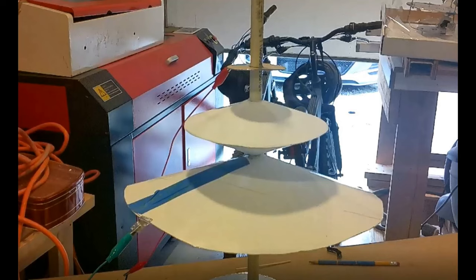Ion wind requires an anode and cathode. You would have to put something in here that was metal on the top and bottom. By changing to this configuration, and we take all of the aluminum foil on the bottom, you absolutely have none that's available to make the connection of ion wind, we can then rule it out. If it continues to have force, there cannot be any ion wind. It must be the charge creating that force.